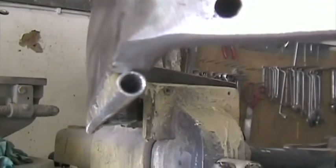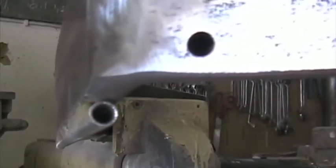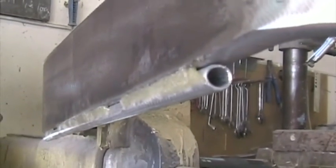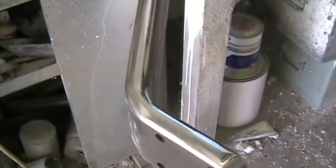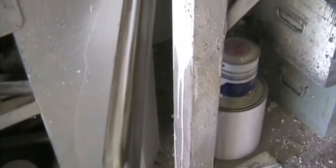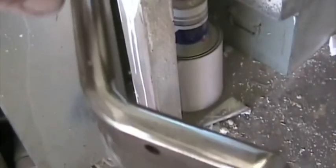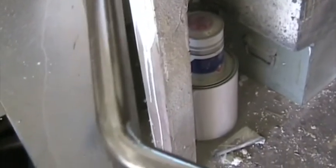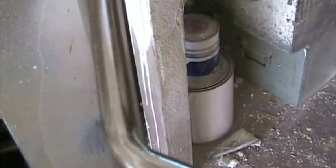I've also bonded on the aluminium tube in which the brake line runs, which I've temporarily bonded on with cotton flox. This is the nose wheel leg, so this rounded edge of the spring steel is going to actually be the trailing edge, and I'll have to form this into a trailing edge shape. I'm going to do that with micro, shape it, and then glass it.